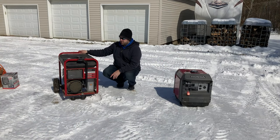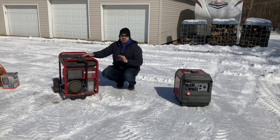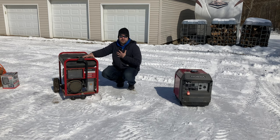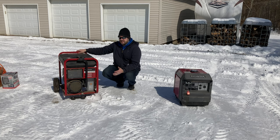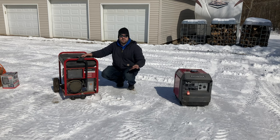This generator is normally kept in the garage. A lot of people commented that you can't run it in the garage — I wheel it to the edge of a man door with the exhaust pointing out, and I keep three large garage doors open whenever it's running, so there's a ton of ventilation. It's not an attached garage. I'm not saying that's okay for everyone. I always recommend running a generator outdoors, but this generator says it must be covered from weather when running, which puts you in a tricky situation. Never run a generator in a living space — totally dangerous.